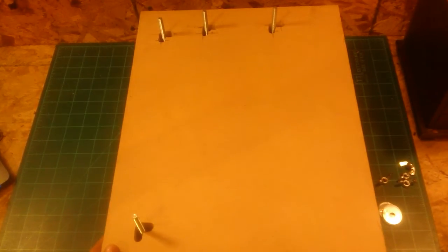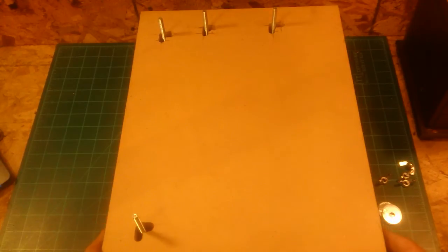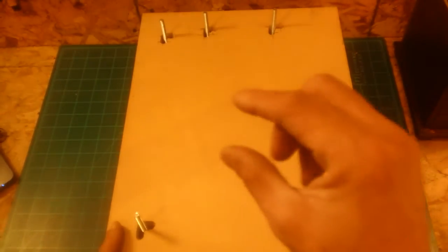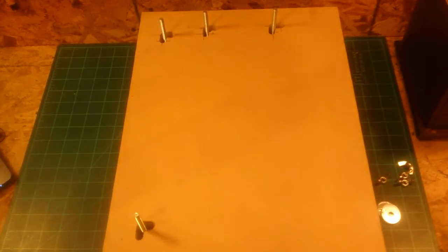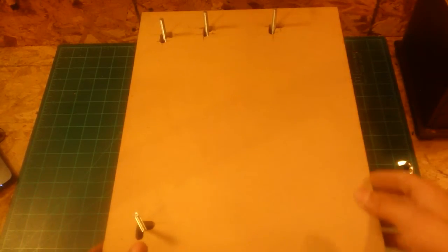And as far as the foam that I used, it's like a fatigue mat that they would use in an office building. Before I was an iron worker, I did temp work for a while, and we were remodeling an office, and they had a bunch of this fatigue mat, and I grabbed it for my shop. That way I could set it strategically in places, but I had a bunch of it left over. The fatigue mat is kind of firm, so you get a nice definition in your press, but it's still spongy enough that it will wrap and consume whatever item you're doing a sheath for. So anyway, back to this, and I'll try to give you as much information as possible.